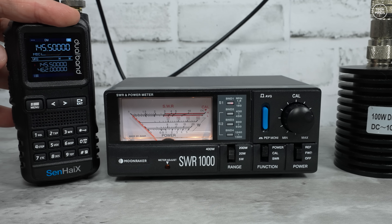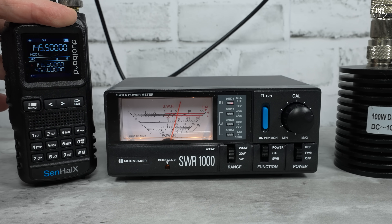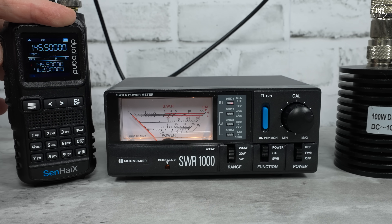Up at 462 MHz the output is around 10 watts — that's even more strange. On the two meter band around 145 MHz with the radio set to high power, the output shows nine watts. So this radio does put out a nice amount of RF.